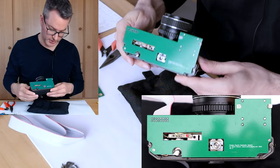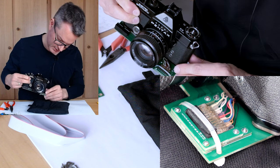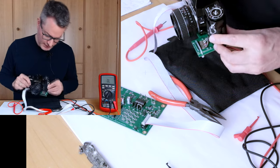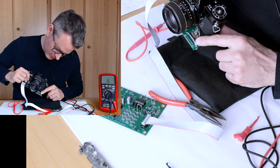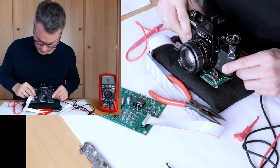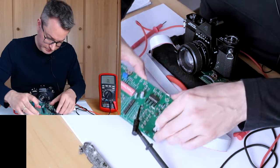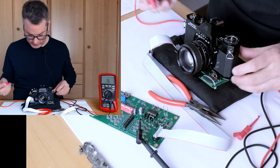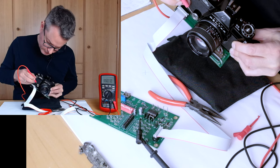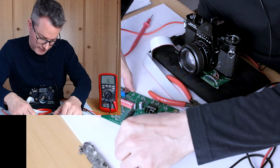From this point on there should be no more mechanical stress on the connector and its tiny cables. I had to place a second layer of rubber here to get proper pressure on the connector. Let's first check the ground connection — it should go to pin 12 on the breakout board, and we test at the camera chassis. Seems fine. And at the other end of the connector we will check pin 2, which is the switched battery voltage, and it should connect to this point on the shutter release switch. Seems fine.